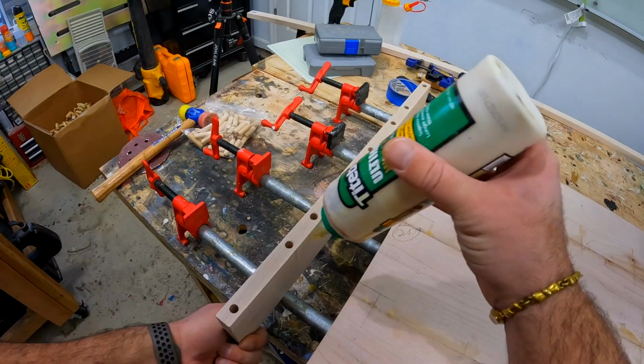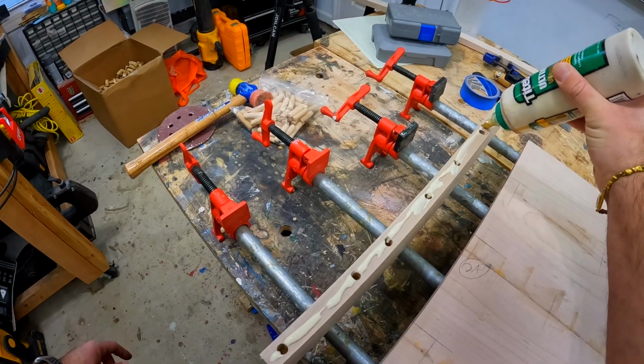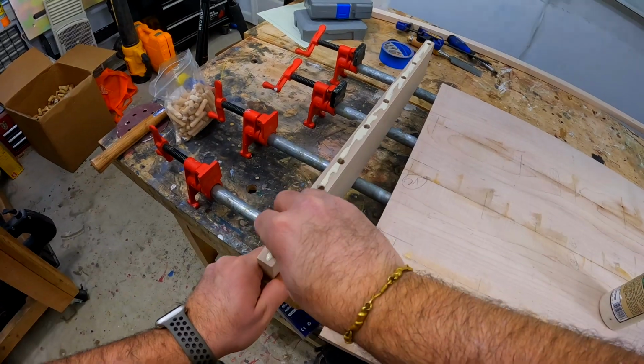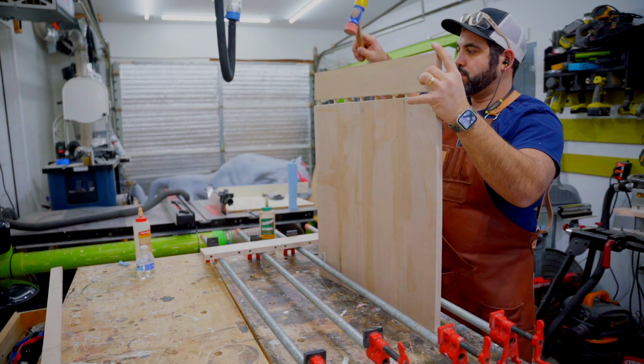This can cause a lot of strain on the boards that have grain running perpendicular to the others, but I'm hoping that using a hardwood that is relatively dry and using wood glue that is waterproof, and just taking good care of the board not to let it get wet or leave it outside, will really let this last as a strong family heirloom.